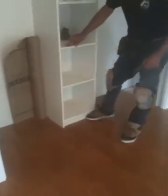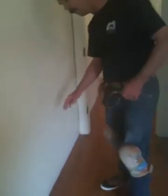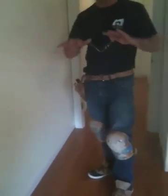And of course, we fit it up tight against things that wouldn't look well if they were molded with a base molding. It looks much cleaner if you install it like this. And everywhere else where the base molding goes, we have left an expansion gap for the floor so it can expand and contract, which we can see right there as well.